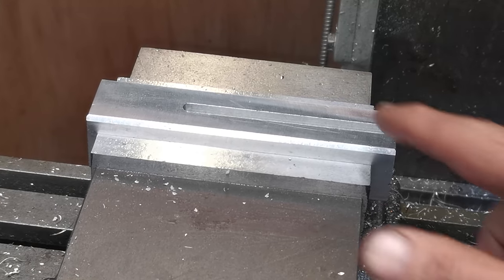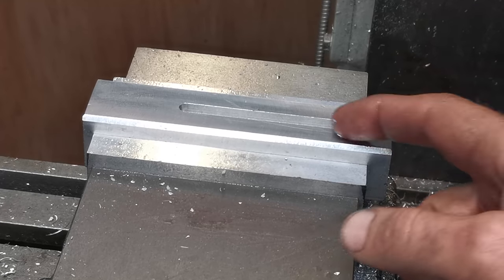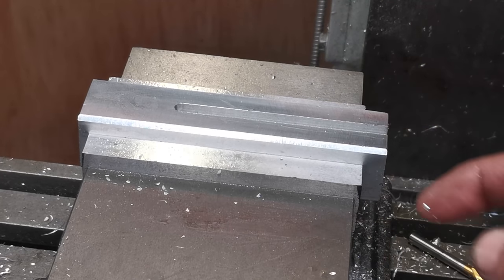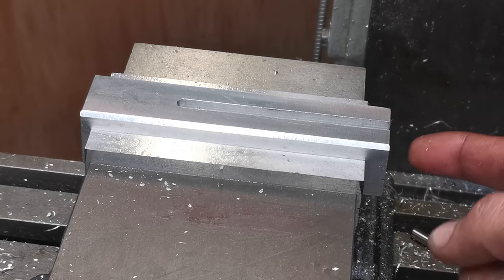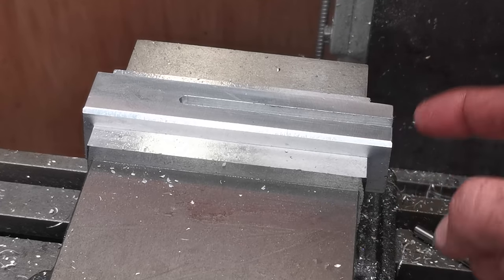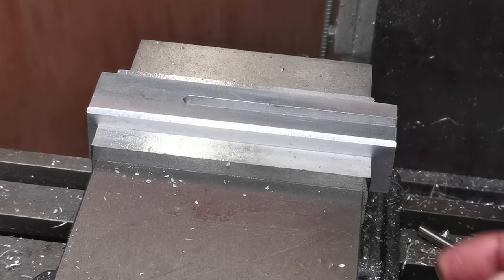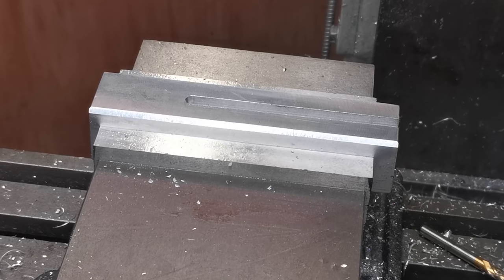I'm not sure if this is a thing or not, but I started milling this slot out which is obviously going to clamp onto the plate. The only trouble is, I'm going to be chomping my way through and we're going to get to a point where there's bugger all holding it this end - I'm only supporting the piece from that end because the slot will go all the way through. I don't want any of this getting loose and floppy because that's the way accidents happen. So I've left myself three mil on this end - I'm going to drill a six mil hole three mil in so I've got some wall thickness, and I'm going to do another one at the other end just so I've got clearance. That way I can just mill up into that position without binding up on the end or losing any support. I'm not sure if it's the right way of doing it, but I'm doing it anyway.